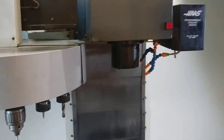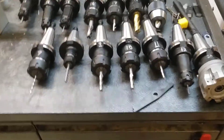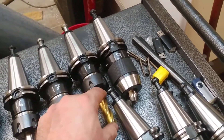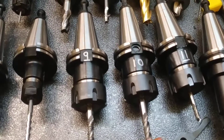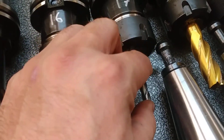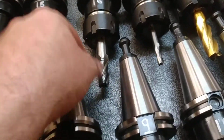With this machine, it's a belt-driven spindle, so it has no low-end torque at all. If you need to turn something slow, it does not work well. What I'm finding is you need to spin your tool fast and you don't want big tools. So instead of milling steel with something large, I'll be using something like this — smaller diameter, spinning faster, carbide.